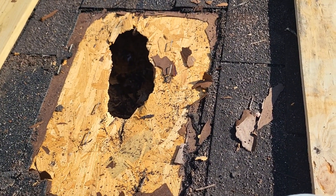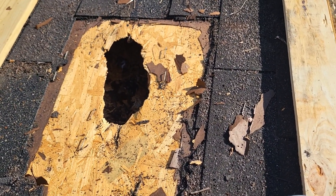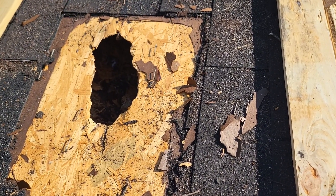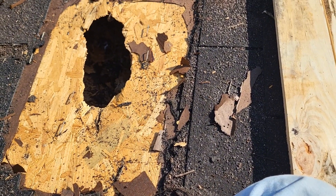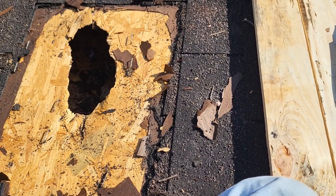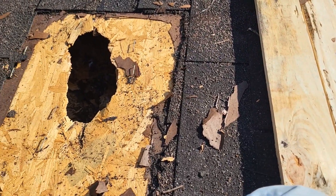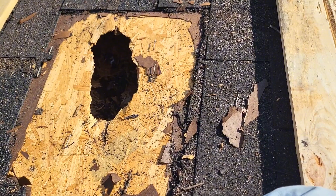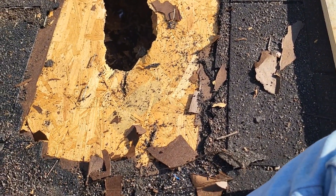I always use screws — I don't use nails. Screw everything back together. Then I can put some tar paper up under the existing shingles. Break out a can of tar or something and seal it all up. In this case it doesn't have to go back exactly because it's getting a metal roof put over top, so it's just a patch. Whether it's temporary or permanent is up to you — how you do it and whether you're keeping shingles. If you're doing shingles, you can just replace them once you get the patch fixed.